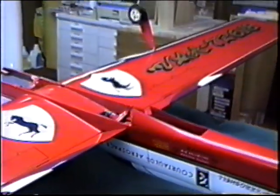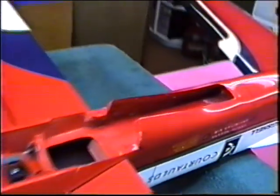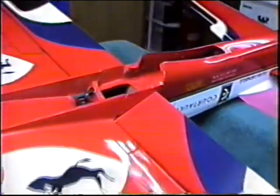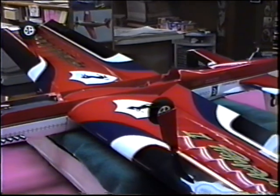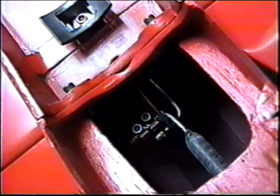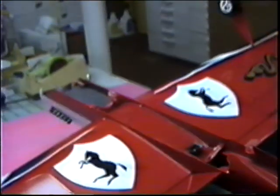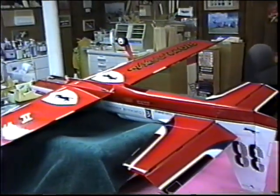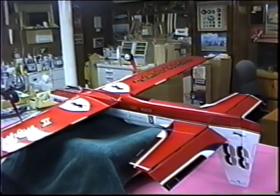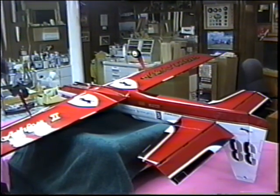And I know Paul Walker has said 1 wheel collar is totally reliable, and yeah, I totally agree with him. 1 probably is, but I know Bob Barron used to use wheel collars, but I'm a coward. I want 2 wheel collars. Probably means you need 3. And it's probably overkill, but like the 3 bolts in the front, I'd rather be sorry by having too many wheel collars on it than not enough. Maybe they are dead reliable, but since I haven't crossed this pond yet, I don't want to be the one to find out that they're not that reliable.